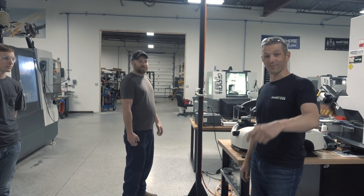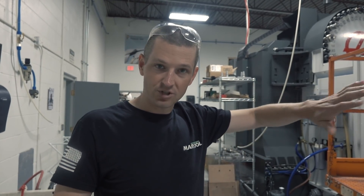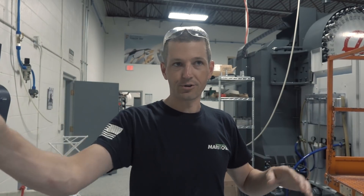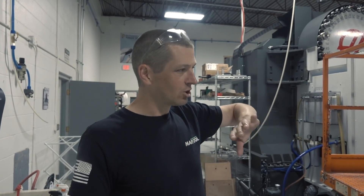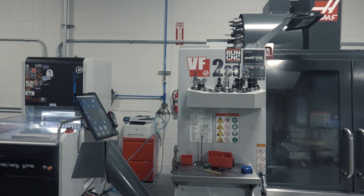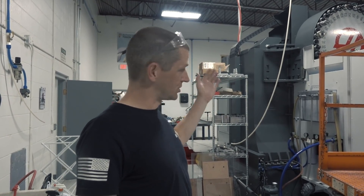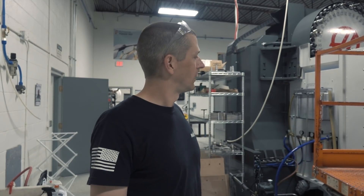The question and debate is pushing the VF2 to the left versus having it centered along this hallway — the hallway being where you'll have a VF6 on each side, then a VM3, then a VMC. It has to do with making sure we've got enough room on the back side to open the electronics door, pull the cooling tray out, get the chip bin in and out. We think we like it there, so we're going to leave it there, pull the rigging skates out from underneath it. Jared's finishing up a plate right now, and then we're going to scoot the VM3 down — it only has to go about eight feet in one direction.